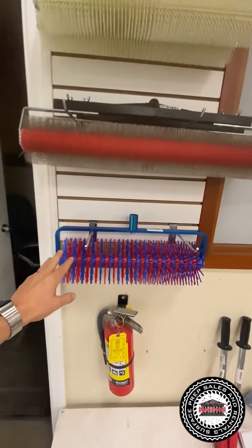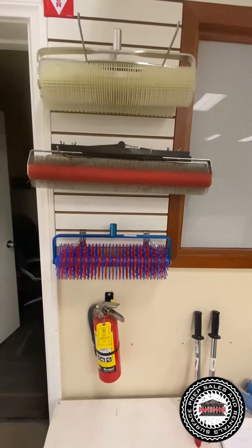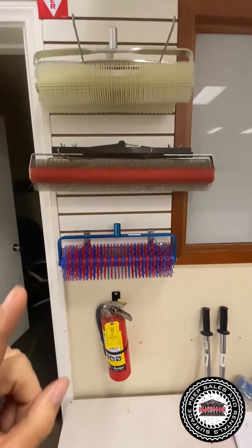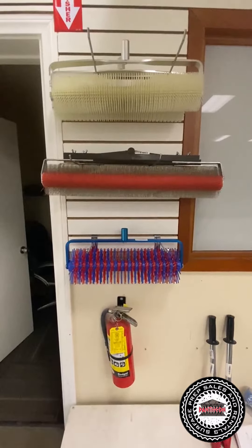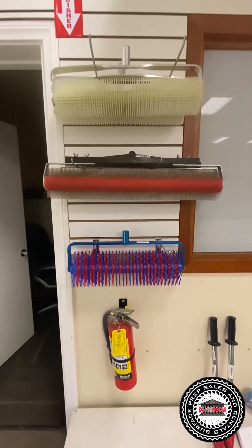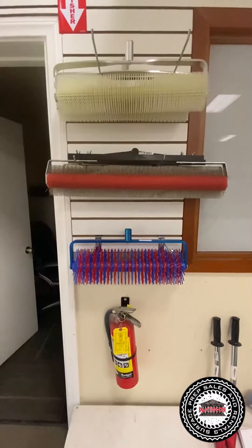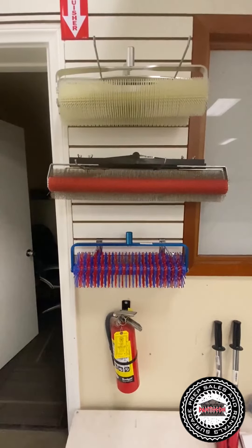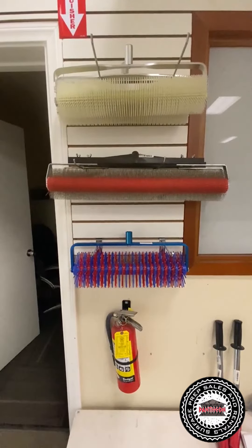That's my personal opinion. Can you do it at three-eighths? Absolutely, but the risk versus reward to me is not there. So just a helpful tip on pouring any of the decorative products: I typically go at half inch. That's what I recommend. If you have issues here and there, you can work them out. If you go three-eighths, you better have a perfect floor and a perfect pour. If not, you can have problems, and having problems on a decorative overlay is super, super expensive.